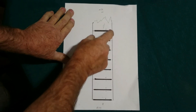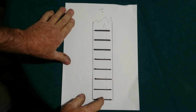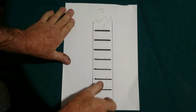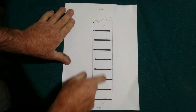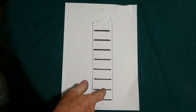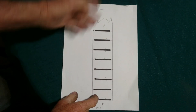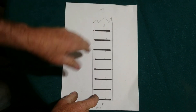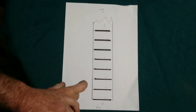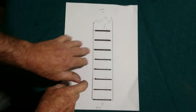Here's the zinc bromide cell in a tube — some experiments in a bit of PVC pipe. This is all carbon felt with a layer of HDPE through it separating each cell. The liquid cannot pass from each cell but the voltage can. It's very similar to just stacking your batteries up externally, but internally in each cell. If you get about eight of these cells that's 12 volts, and it's about 200 millimetres long. You could put 30 in and have the battery two feet long. For increasing the voltage output of the battery — of course I can't increase the amps — but that's my way of getting around it.